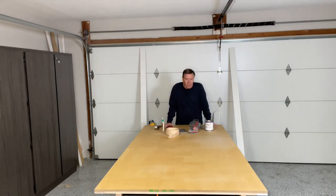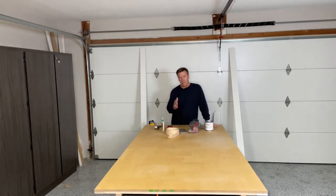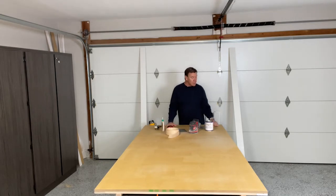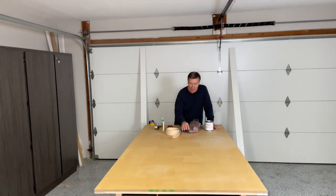When you go to purchase materials, that's really critical to how hard or easy this project is going to be. I first thought I was going to use some pre-finished birch plywood. But when I went to three different home improvement centers, I couldn't find one that was straight — they were all wavy or crowned. Hang a door like that with a crown and it's going to look horrible. So plywood was not going to work. I decided to go with medium density fiberboard, or MDF.